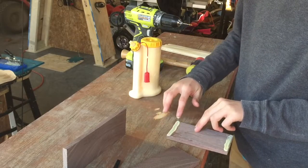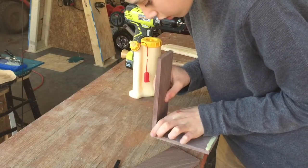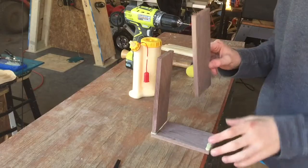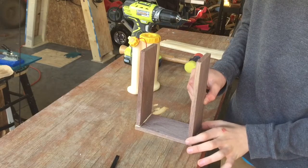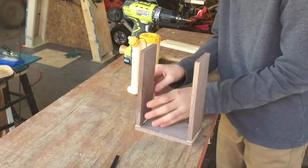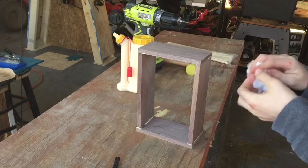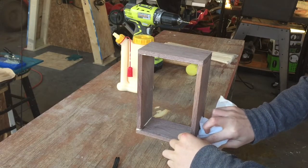You don't need to get real heavy with the glue — just enough to hold it for an hour. Put the side you don't want to see on the inside. Line up your ends, and if your boards aren't exactly the same width, make sure they line up on one end. Get a damp rag and wipe away the glue — wiping it away now will make your life way easier, since it's harder to sand away dried glue than to just wipe it off. Make sure you do this very important step.